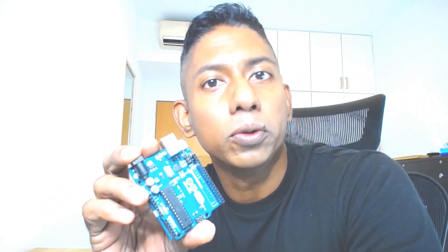Most of you are familiar with this board known as the Arduino Uno. I've probably done a lot of sketch programming on this device. The main component on this board is this chip known as the ATmega328P microcontroller. What I'm going to show you is how to program this controller in bare metal — that means at the register level. In this video we're going to be focusing on the GPIO configuration and how to program some input and output using this bare metal technique.